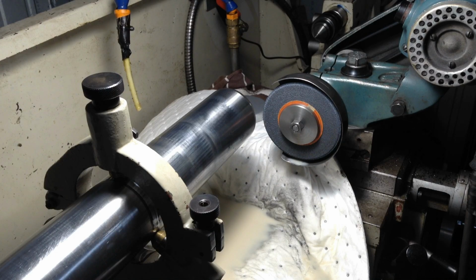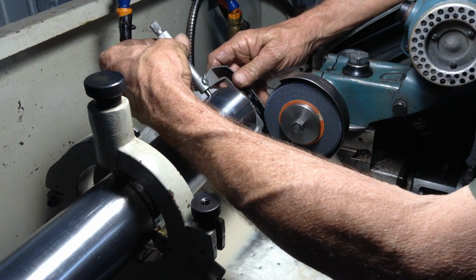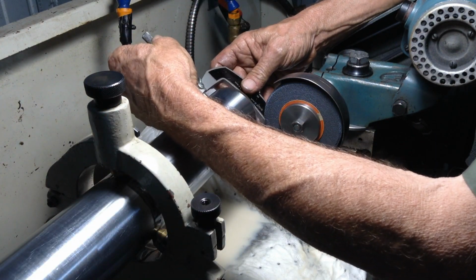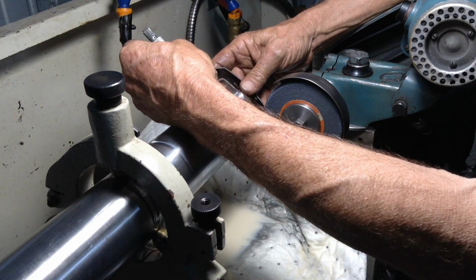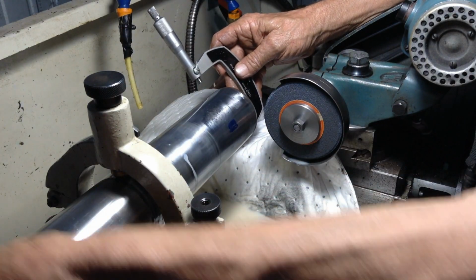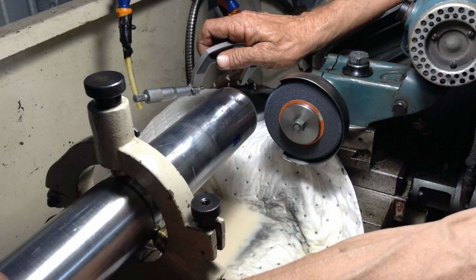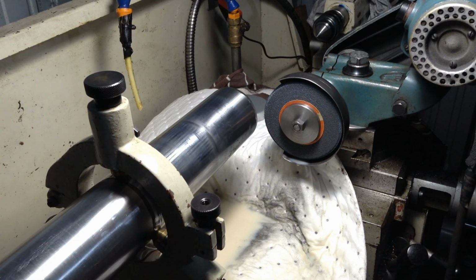Let's take a closer look and have a measure. So 70 is our nominal size. Okay, we're about 1/100th of a millimetre up here. Pretty well on it that way. Hundredth up there. So we haven't quite got a full clean up yet. Certainly our big mushroom's gone, so we'll just go a bit more and I think we'll be in a good position.